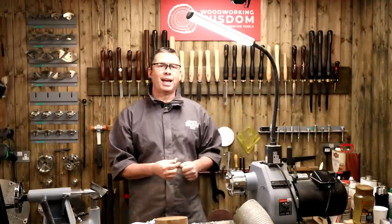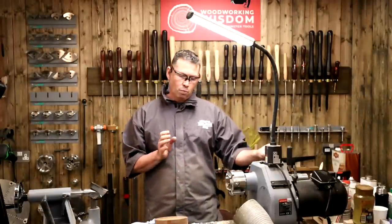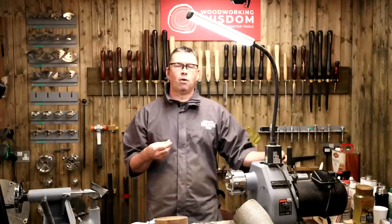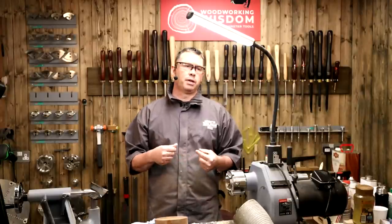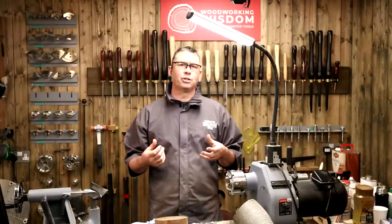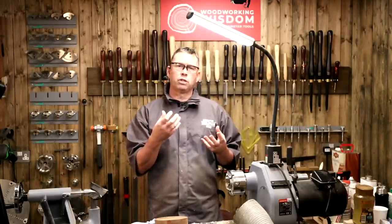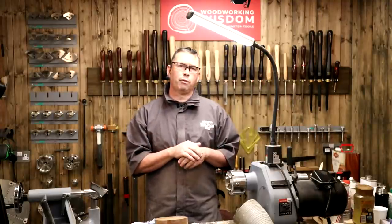I used to say old paint and things like that, but it does get a little bit messy. Anything to seal the end grain works. If you're thinking about a finish, the trouble with doing that on anything wet is it won't last very long, because of the moisture that's in there. And also, if you're using timbers like ash, the minute you turn them, they react and oxidize and go pink, which you really need to sand away before you finish the piece.